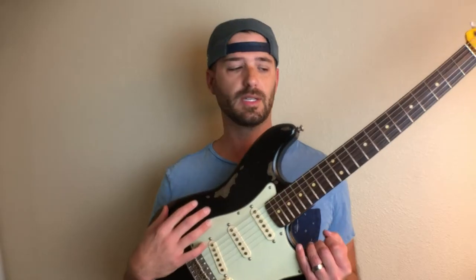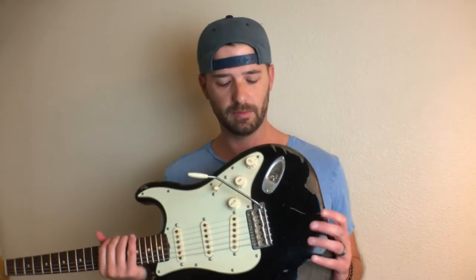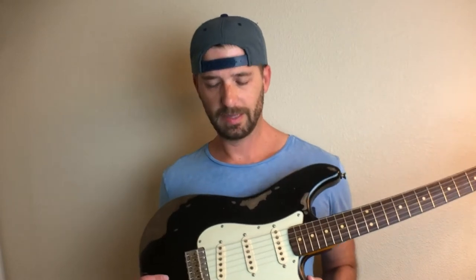What I did is I started with a two-piece alder body, unfinished, and a custom neck that was also unfinished. I tinted the headstock and neck with nitrocellulose, and finished the body in nitrocellulose black, then covered everything — top to bottom — in a nitrocellulose clear coat. I bought some Fender parts and other quality parts, trying to keep everything under about a thousand dollars, so you can really tell that labor costs a lot when you think about Fender Custom Shop guitars.